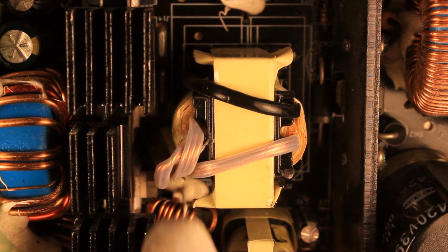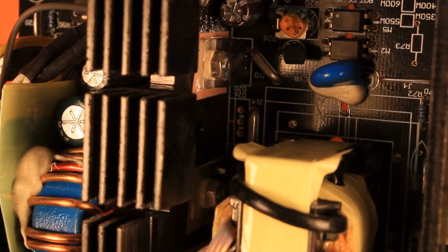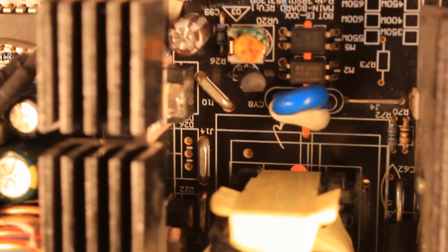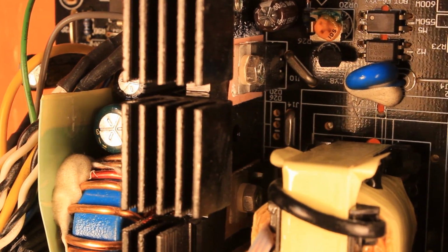On the secondary side then, so this is the primary side on the right hand side, this is the secondary side. So here then they have 1, 2, 3, so they have 4 times 2 double Schottky diodes put in parallel. So one side is here, and on the other side you have the same thing in parallel.